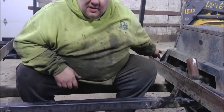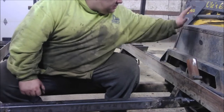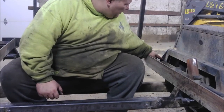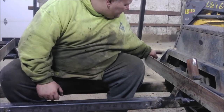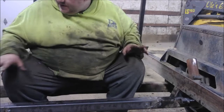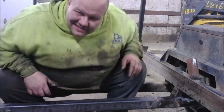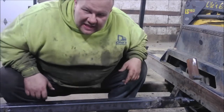I also did this fender — it was flopping loose, so we took it, cleaned up and cut off all the old weld, ground it down, and added a gusset. He said he's never had a problem with any of the other fenders breaking off, just this front portion right here. I'd imagine it's because it's on the passenger side — he's not a good driver. Just kidding, Neil.